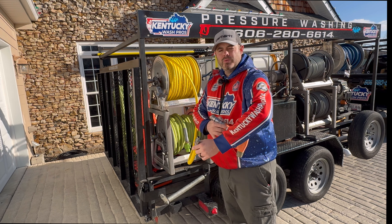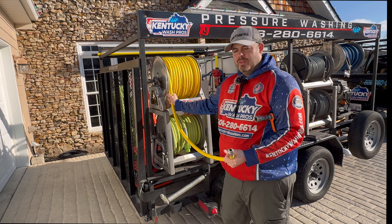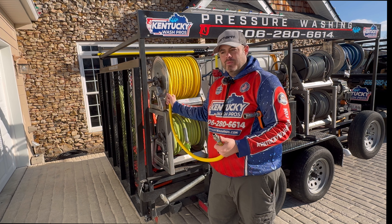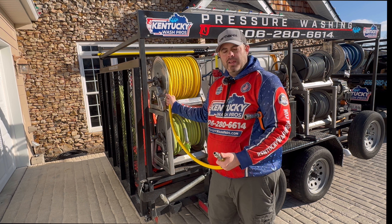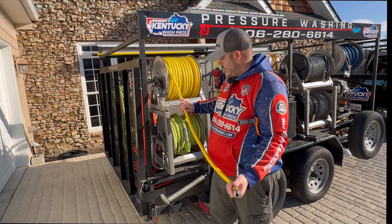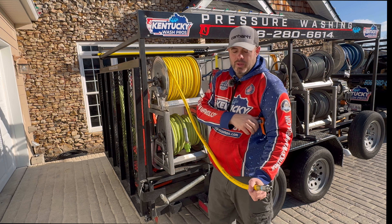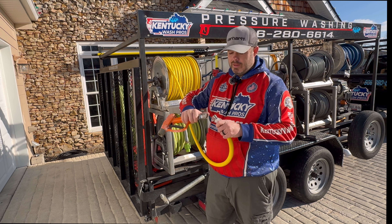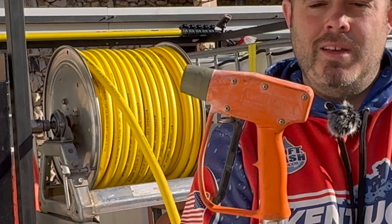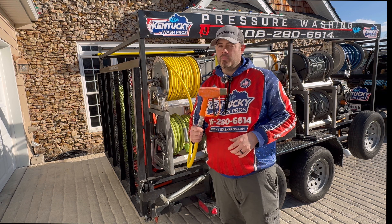Now I want to talk about our soft wash hose. Soft washing is a vital part of a pressure washing business because you soft wash houses — you don't pressure wash houses. With a dedicated soft wash system you can also clean roofs. If you've ever seen those black stains with moss and stuff, this is how you apply a stronger chemical. This is a Soft Jet, which is Flex Jet — it's a 5/8 hose on a stainless steel reel with a quick connect. This is a Water Boss gun rated at half inch, 750 PSI. It looks like it's been through the ringer but it just keeps on going. We've cleaned a lot of roofs and commercial buildings with this.